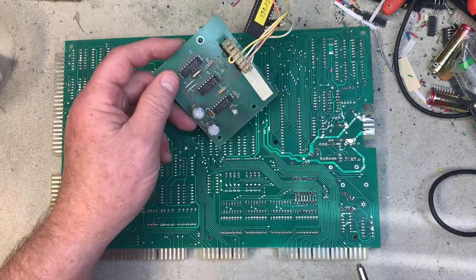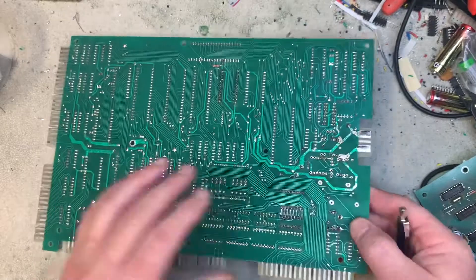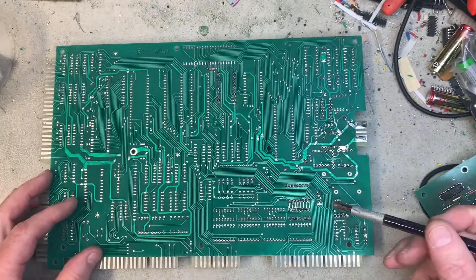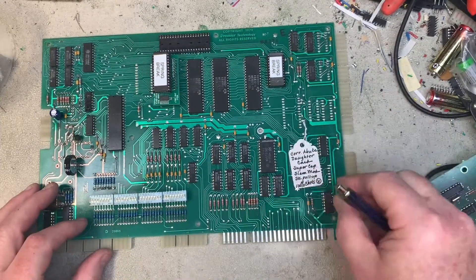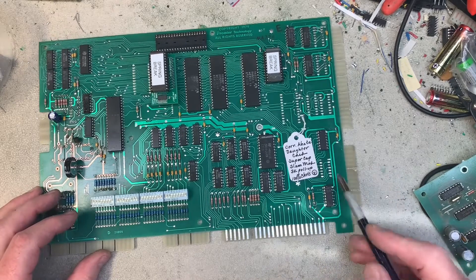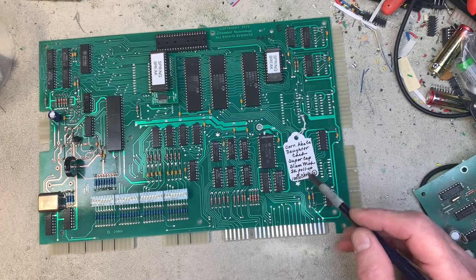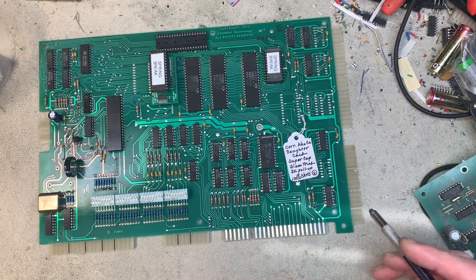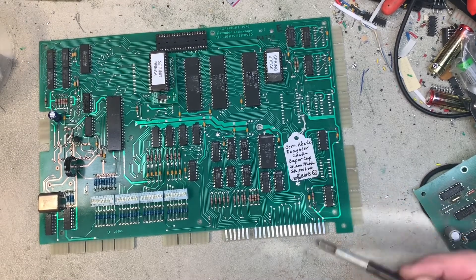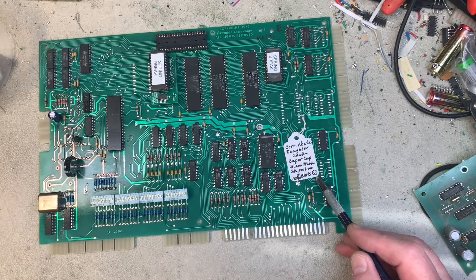You don't need to use those old reset boards — they cause more trouble than they're worth. I've got some solder flux to clean up on the back of the board, but this board is good to go. I always add a hang tag to all my boards, and I appreciate when people leave those on there, so if I ever see the board again I know exactly what I've done to it. On the tag I list everything I've done. When I finish testing a board in a game, I write '100% Chris' and a circled V to indicate I've made a video of this board being tested.